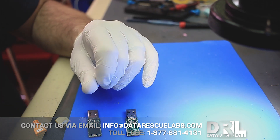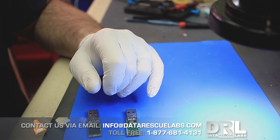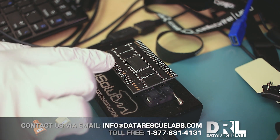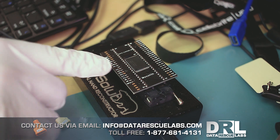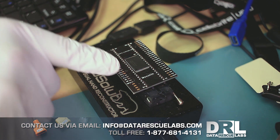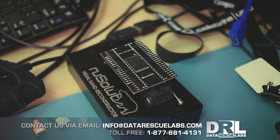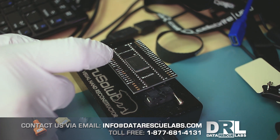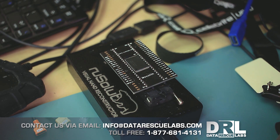This should be a pretty good job as long as the problem is just the USB header — we'll find out. The last one I've already plugged into VNR and started recovering. I'm not sure if it's fully recoverable, but I'll try anyway. This chip is not in its socket — it's actually soldered onto the test board. The drive was showing its size, which is 16 gig, but it wasn't responding, which doesn't usually mean controller failure. I think the chip itself is failing.